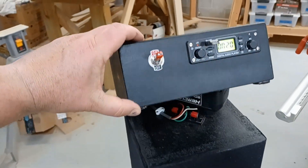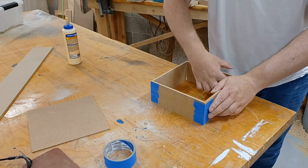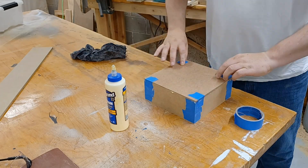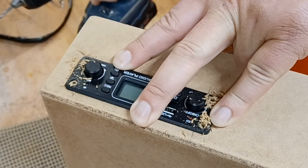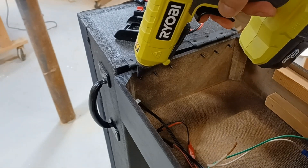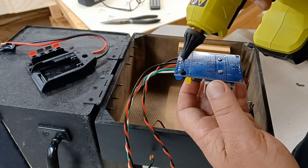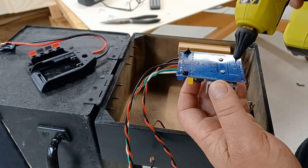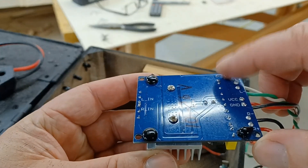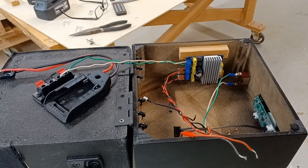To keep things tidy, I went with a hinged top type of thing. I made the top out of 1/4 inch MDF with mitered corners, and the very top cover is also 1/4 inch MDF. I had to be careful cutting out the opening for the preamp since the mounting holes are uncomfortably close to each other. After painting it black, I threw a few cheapy hinges on it — and since the screws were a touch too long, I just glued some black hot glue on to cover the sharp pointy bits. Since I didn't have any standoffs for the amp board handy and the hot glue gun was already percolating, I just glumped a few blobs onto the backside next to the mounting holes to serve as standoffs. Hot glue is almost as handy as duct tape.